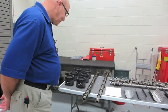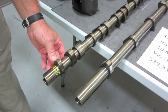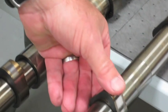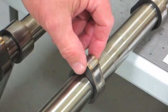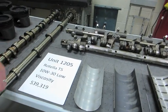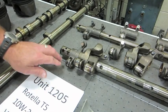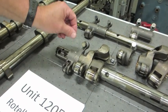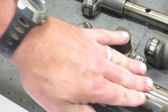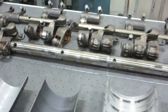So if we come over here, this is the exhaust camshaft, and we see a wear track on the cam lobe, but we don't see where it's moving metal around. The same thing goes for the intake side — this is the intake camshaft. We can come over here to the rocker shaft. The camshaft rolls on these roller followers, and this is the exhaust side with the engine brake included, and we're looking for any point of wear. These are the contact points on the rocker arm and rocker shaft itself. Again, we see a great level of protection.